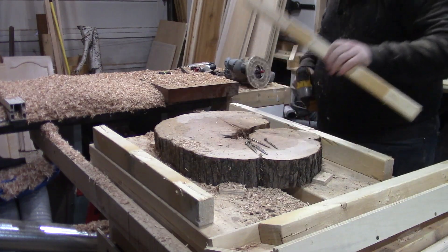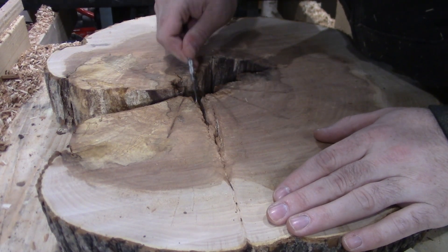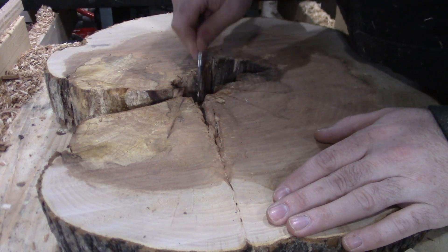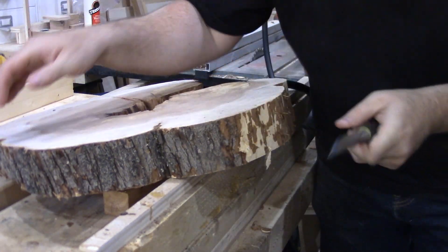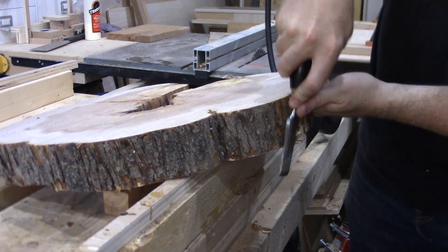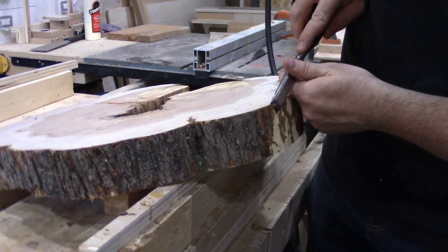Once that was done, I could lower the rails, flip the cookie over, and resurface the original side. With both sides surfaced, I moved on to getting rid of the rotten material, which I took care of with some dental picks and files, which got the majority of it out. Next I moved on to removing the bark, which I took care of with a chisel. This probably would have been a bit easier when the wood was still wet, but eventually I was able to take out all of the bark and get down to the sapwood.